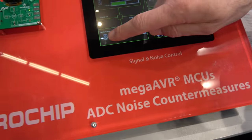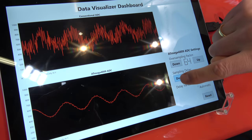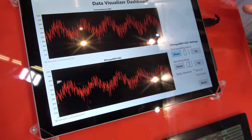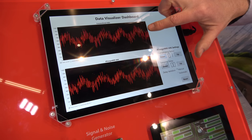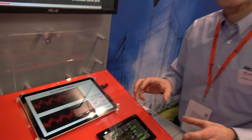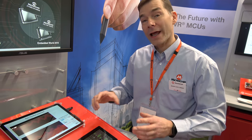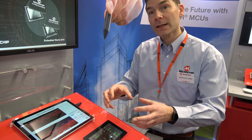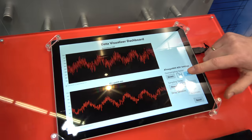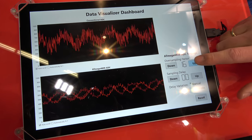In reality you typically have noise. So let's turn on random noise. Here you see the standard operation of an ADC — the noise on the signal is measured as well. But this ADC has fantastic hardware capabilities. You can do hardware averaging, meaning you can actually do filtering in the ADC itself without spending any CPU cycles. As we start adding oversampling, you can see that the random noise is attenuated.